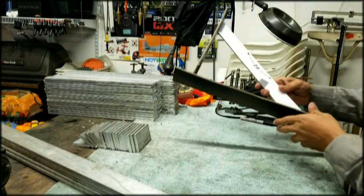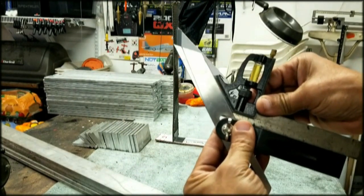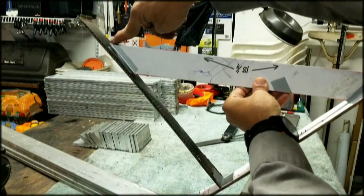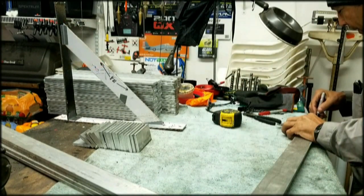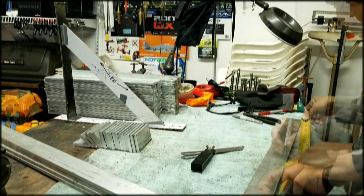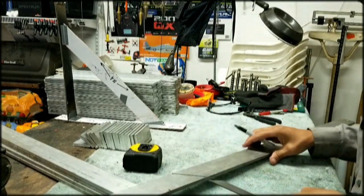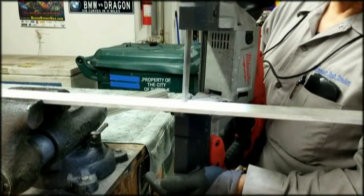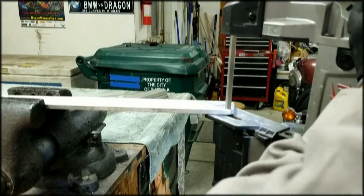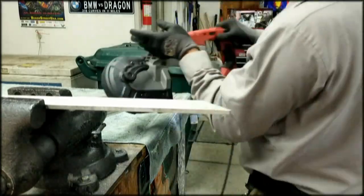The brace was 45 degrees, as I mentioned before, and for that to be 45 degrees and sit where I have it on the model, the extreme ends, the longest part, needed to be 18 1/4 inches. So, broke out the Sharpie, got the little angle finder, and marked all my stock. Making the 45 degree cuts with the portaband was a challenge. There are stands on the market that make cuts like these simpler with this saw.